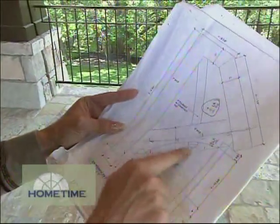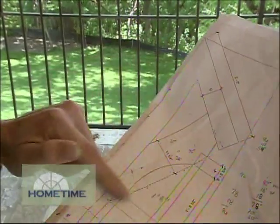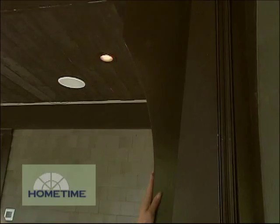Now we're getting ready to install the brackets that were designed to go under the eaves over the dining room bump out, as well as the ones that they drew up to go under the eaves around the garage. They're similar to the ones on the side porch because they involve cutting some large curves into some fairly large format Western red cedar, just like the ones that we have here.